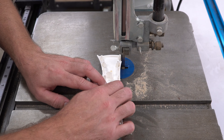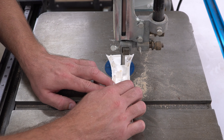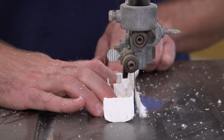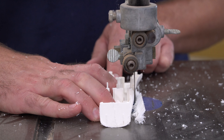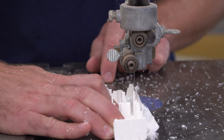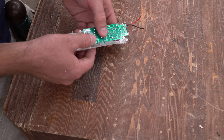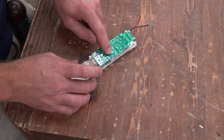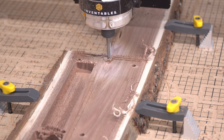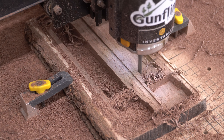Switching gears to the handle now — this is the one place where I would do things differently if I was starting over again. The racket I started with had an on-off switch in addition to the little button you hold to apply power to the wire mesh. I'm pretty sure this is why there's an entire circuit board involved where I expected to find only about three wires. If I were starting over, I would find a simpler racket that would allow me to make a smaller handle. As it is, I decided the best way to keep all the scary electronics in order was to bury the mount for the circuit board into the handle. I trimmed it down as much as I could, but that still left me a bit larger than I would have liked. The handle comes together the same way — just two halves clamped together around the electronics. Since this was just straight lines, I was able to make the drawing from measurements alone and didn't have to mess with pictures or tracing.